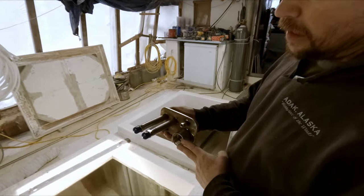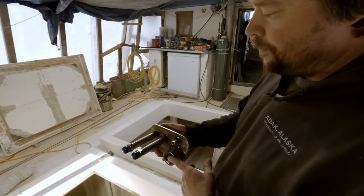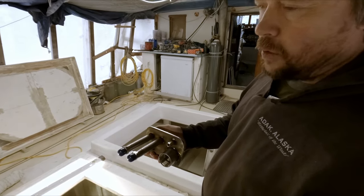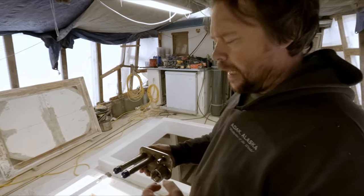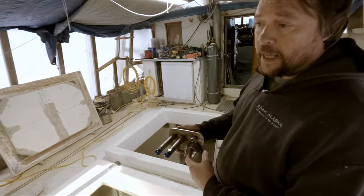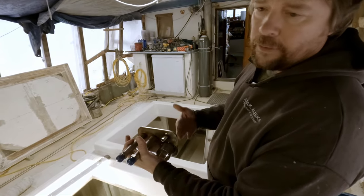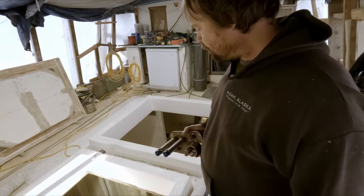On one side, it's just gonna be a drain line, like I say, to drain any water that might accumulate back there. And the other side will be for our fresh water line to feed through. And so we're just gonna use, I think, 1/2-inch PEX. Yep. And it'll be sleeved through some 1¼-inch conduit. And that way, if we ever break a line or we need to pull that for any reason to replace it, we can easily just thread it right back through that conduit. So just kind of some future proofing there, I guess.